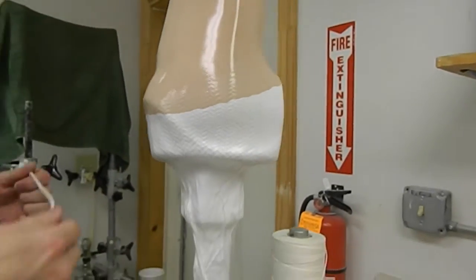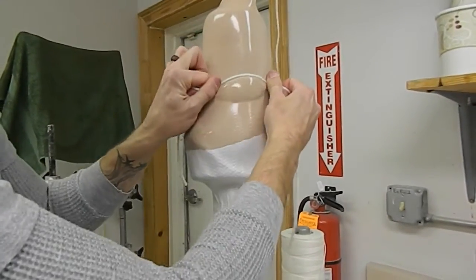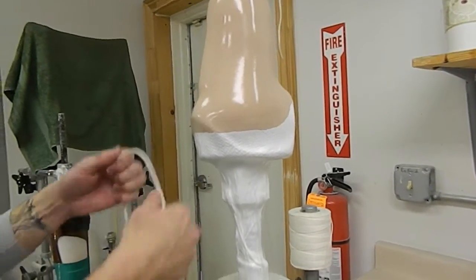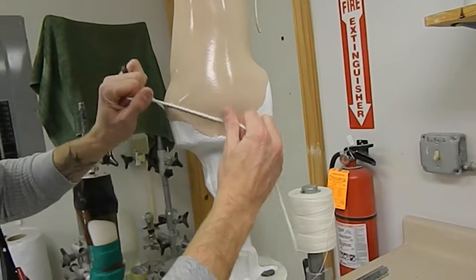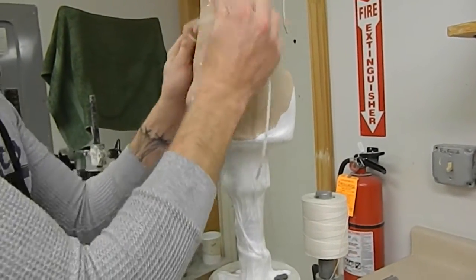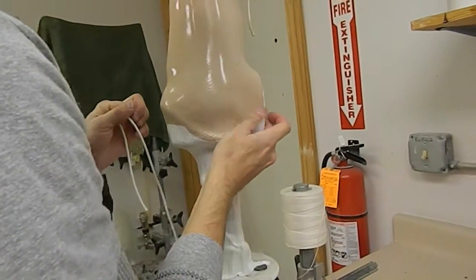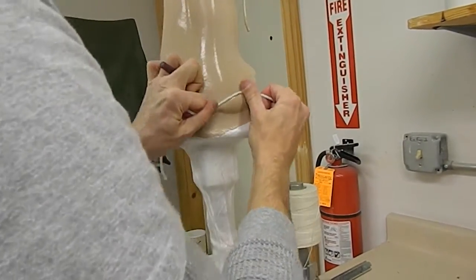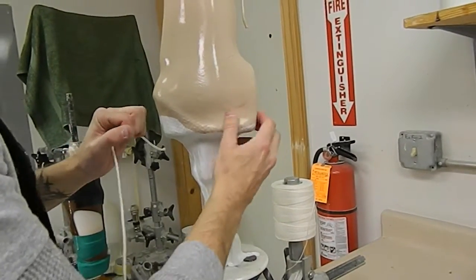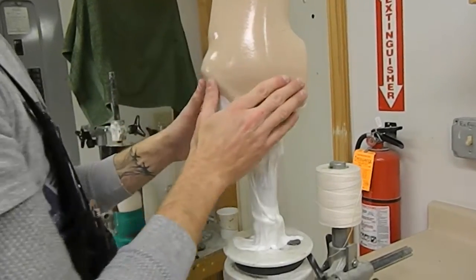What I'm doing now is partly pulling the air out, but also pulling my resin down — because I know my trim lines are going to be down here, and I need to have the resin in there. I pull it down so I've got it just past my trim lines. I don't want to hold it past my trim lines. You want to make sure you've got enough resin for all the walls and the carbon fiber to absorb it, so you don't have any air gaps in between.